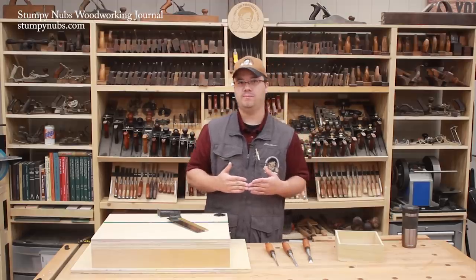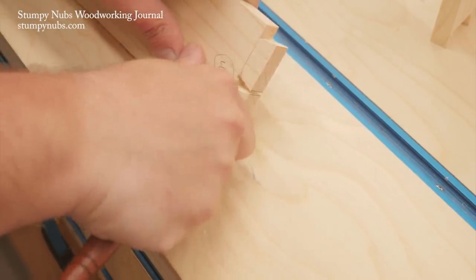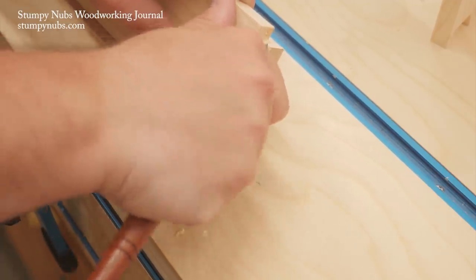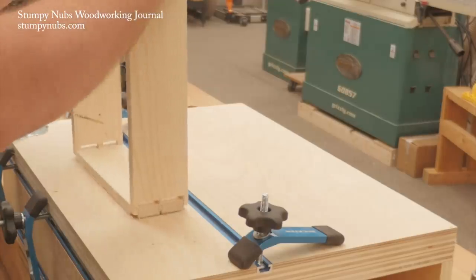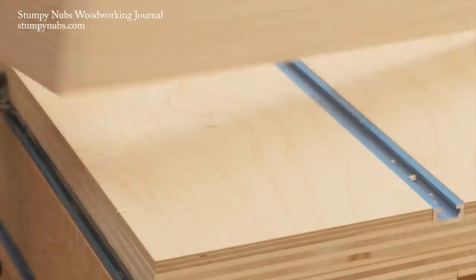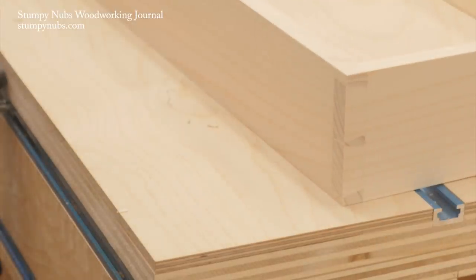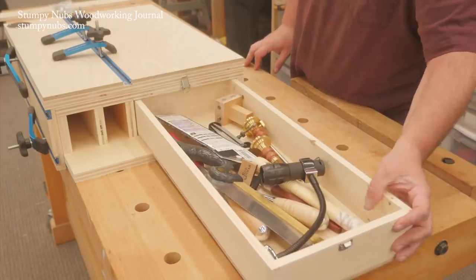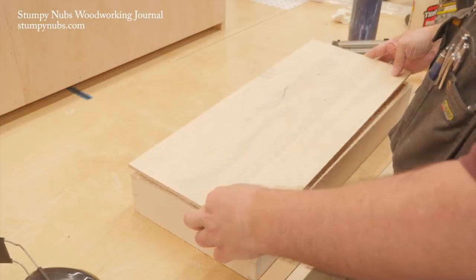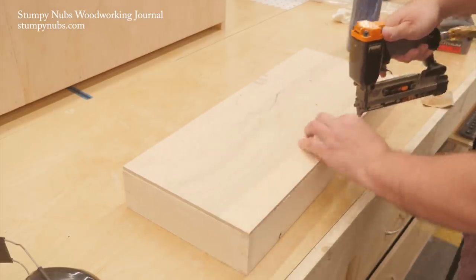One last task before assembly: I like to cut chamfers on the inside of the tail, staying away from the corners. This will help the joint slide together. The nice thing about pine is the joint can be a little tight and the wood will compress, but don't pound too hard or you may split your board. If it's too tight you might just have to do a little more work with the chisel. This is a shallow drawer — even if you fill it with dovetailing tools the contents won't be very heavy, so I opted to keep it simple by just gluing and tacking a plywood bottom on. It will be plenty strong.